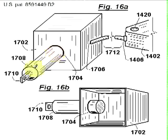As you can see, there's a cylinder here in the upper left part of this, and down here we've opened the box a bit, and that would be probably a cylinder, but it doesn't have to be. And we have a shaft. It's a piston, actually. I said this was a cylinder. It's actually a piston. And as the piston is driven into the box, fluid is driven out and into the equilibrator. The rate of return from the equilibrator, as transferred back to the piston, is constant. Of course, this also has applications for opening and closing hatches and doors, raising landing gear, lowering the landing gear.